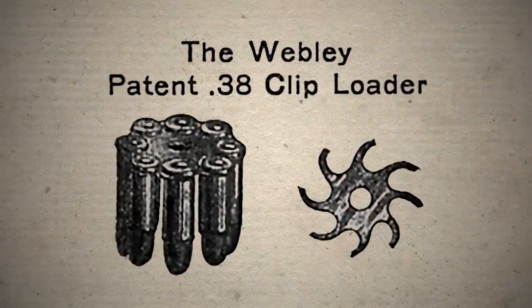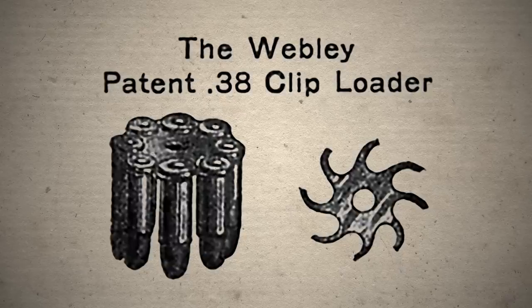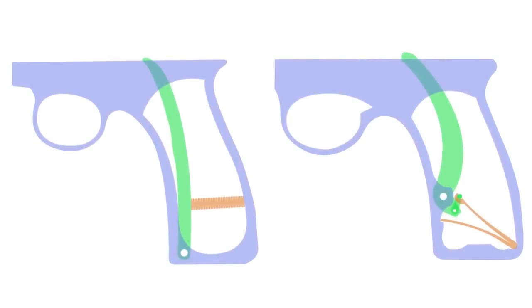In adopting a smaller caliber, Webley could make a smaller handgun, but the grip size and profile was a pretty strong feature. Instead, they would only slightly shrink the frame, about 1/2 inch shorter. The cylinder would also be shrunk a wee bit in length, but the diameter remained basically the same because they bored 8 chambers instead of 6. Again, Whiting paired the new gun with a quick-loading clip, now holding, of course, 8 cartridges and clearly beating out the World War I 1917 moon clip. Moving to the internals, the previous Fosberys had used a coil spring set inside the grip to return the upper assembly.